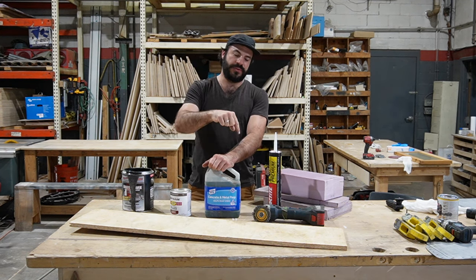And the only bus we framed was mine, and that was my bad. So we've been doing it this way for almost 8 years now. We've had no dips and low spots and no issues. I'm a huge fan of doing it this way. You eliminate the thermal bridging, you save an entire step of framing out the floor, and you save money on materials.